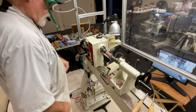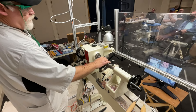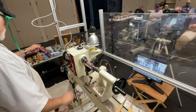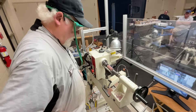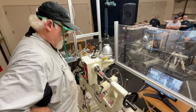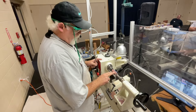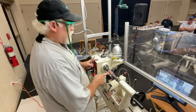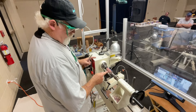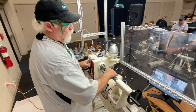My plan this evening is to do this start to finish — maybe not applying a final finish — but basically the design, a touch of sandpaper, and then some coloring and texturing. If you want to do a tree, you could taper from base to top. If you want beads or balls, now's the time to take out a pencil, draw some lines, and divide into thirds or however you want. You've got a blank canvas at this point.